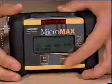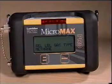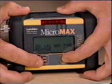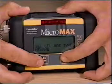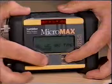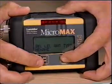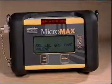Select LEL Gas Type. The first option displayed is Select LEL Gas Type. This programming option allows a user to calibrate with methane but obtain direct gas readings equivalent to methane, pentane, propane, hexane, or xylene. To program the unit, press on-off to access the menu. Use the mode button to select the gas type and the on-off button to lock in your selection, exit the menu, and advance to the next option.